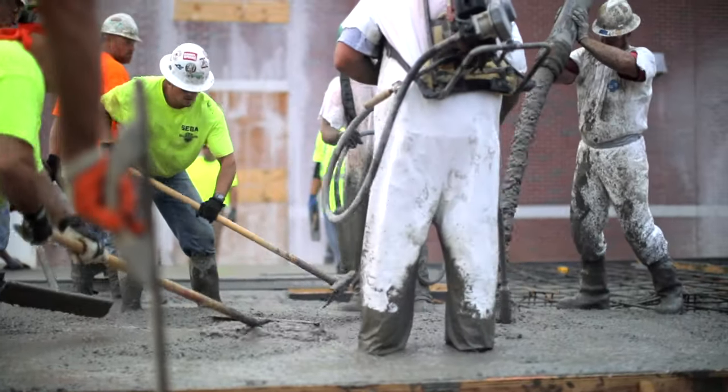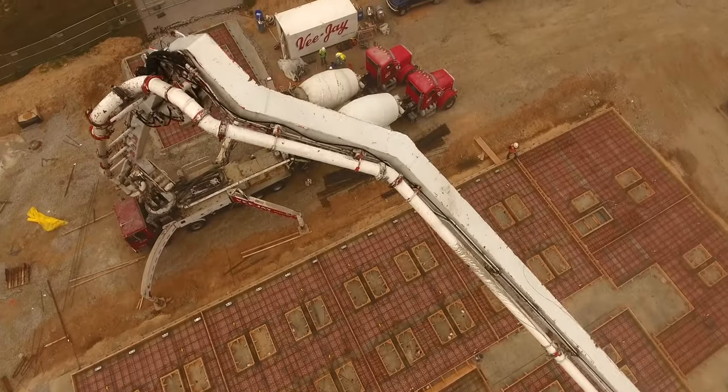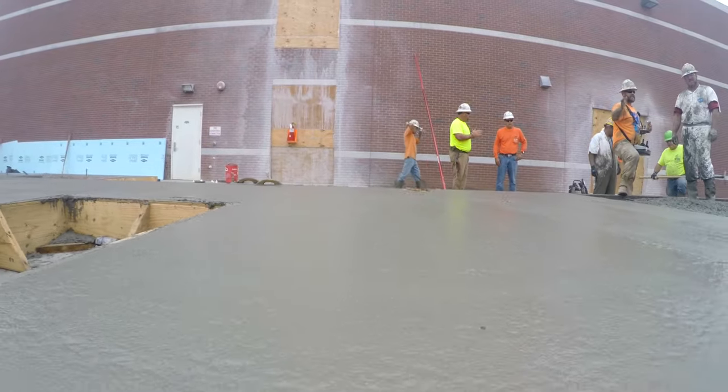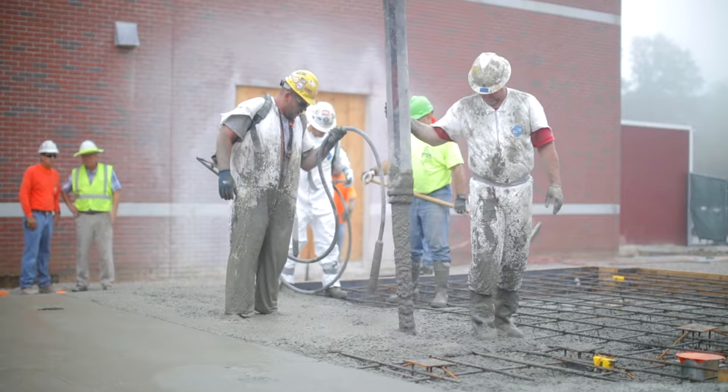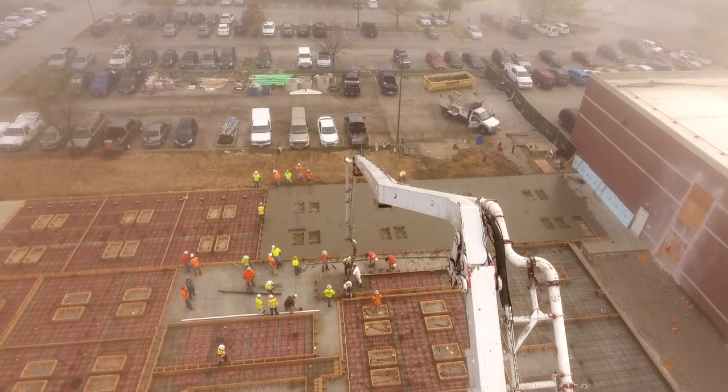To get that all finished, we put the two layers of rebar in at two different levels. Basically, we pour the panels full of concrete, which is a one-day process. At that point it takes three to four days to cure until we get up to strength.